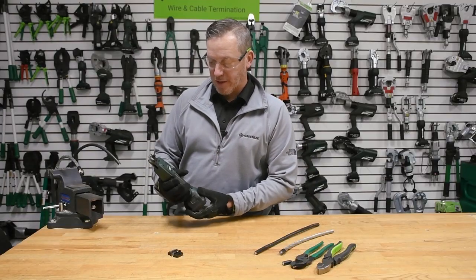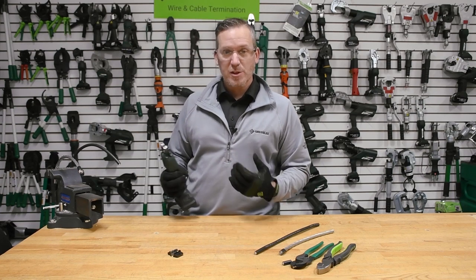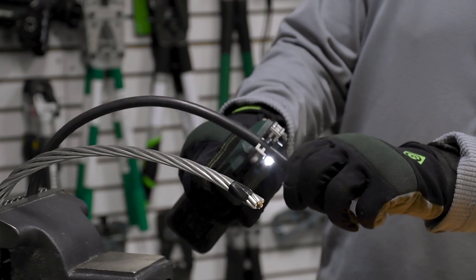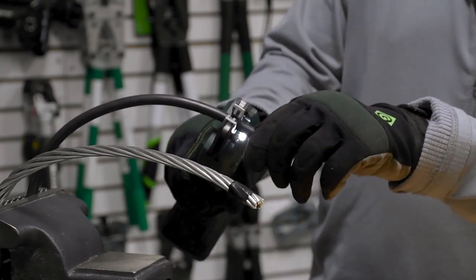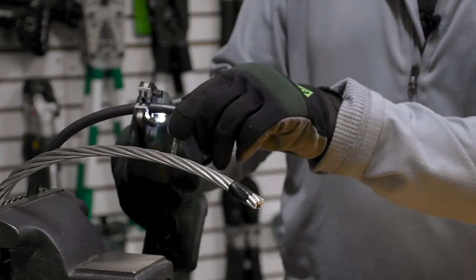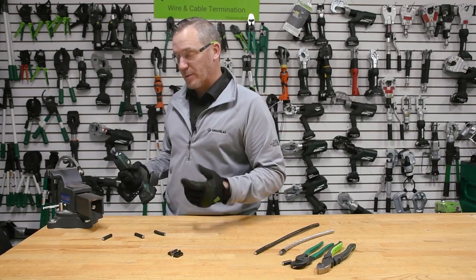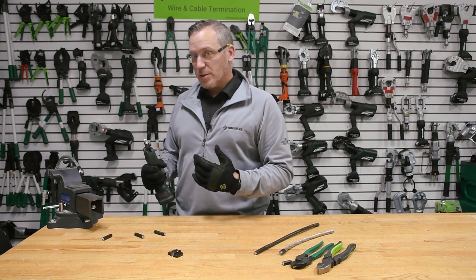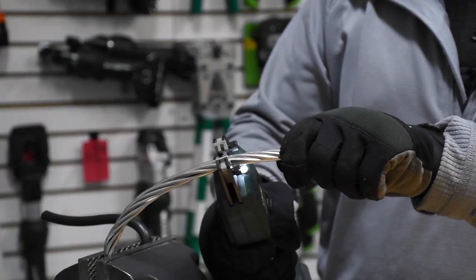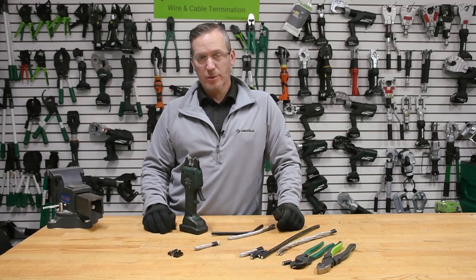Just to show a little bit of that benefit from the Micro — the EK50ML with the cutting jaw application — I'm going to go through some simple materials a couple of times and we'll see how easily this thing cuts through aluminum. As you can see, it makes very short work of that aluminum. Now let's work with a little bit tougher material: small gauge hard metal like this number two ACSR. The EK50ML crimping and cutting tool from Greenlee.